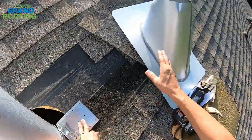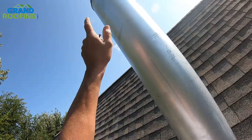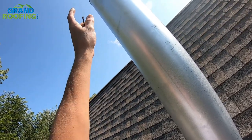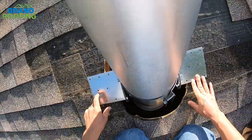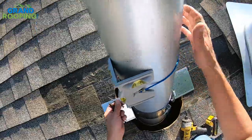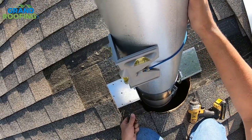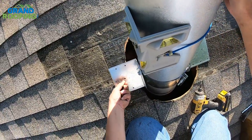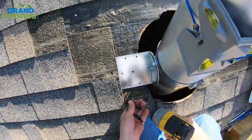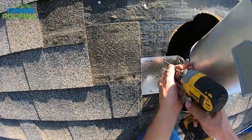We're going to screw these down into the trusses so it's secure, tighten everything around and hold the pipe nice and solid. Slip the flange down over it and start putting the shingles back. After that, it would be the last section of pipe — which he thinks he got too long — and the cap and a couple of supports. At a later point when he orders the shorter section, we'll just twist that top off, switch the vent cap, screw the new pipe on, good to go. Let's make sure we're clear around everywhere and that it's pretty vertical — that's barely at the tick mark there but I think you're good; that looks like two inches.